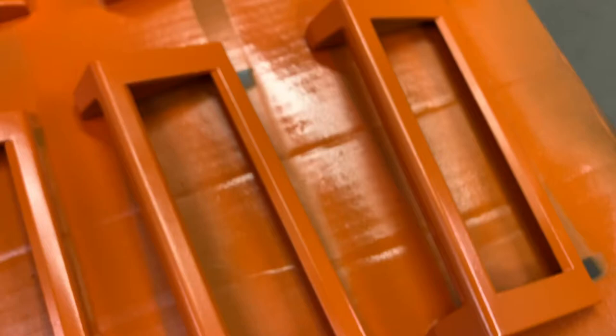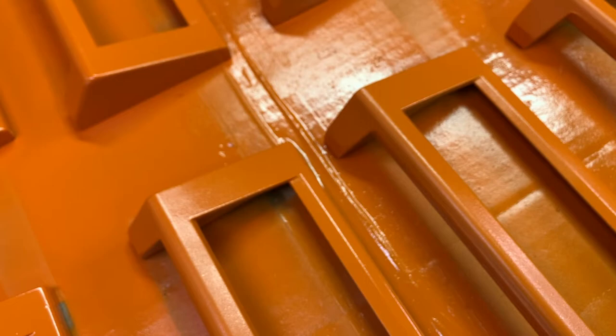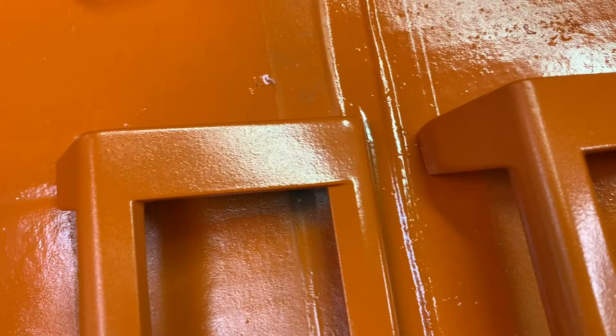All right, we're back. It's nighttime. Glass of wine. We got our painted covers here. I have to say, no affiliation, but I'm not super thrilled with this Rust-Oleum Orange. I mentioned before in one of the earlier videos that I had a lot of trouble with it running and just not laying out very well. It's really just the orange — I've had good luck with other colors. There's something specific about this orange I'm not a big fan of. I don't know if you can see it on the video, but we got a little bit of running, a little sag there from that last coat of paint. The last coat also left this orange peel kind of surface finish. It's just really inconsistent from can to can, and coverage-wise I haven't had the greatest luck with it. But it's just a file cabinet in the shop, so we're gonna put it together now.